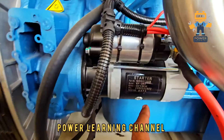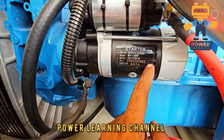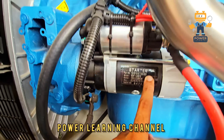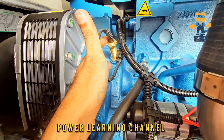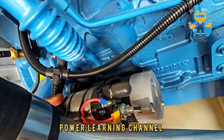The battery is connected to the starter motor. The starter motor is 12 volt, 3.8 kilowatt. The starter part number is 1001157368B. Here this is called the MPU — magnetic pickup unit. It gives the engine speed signal to the controller.